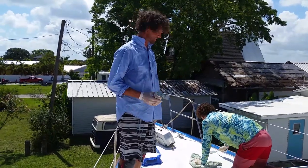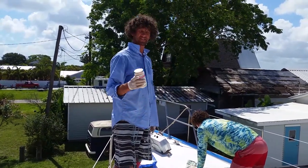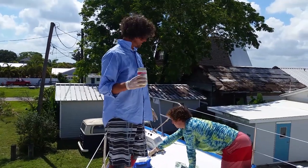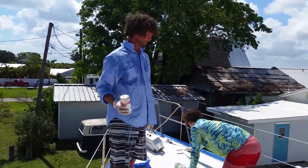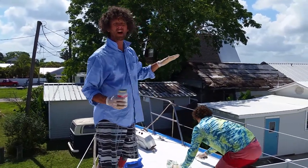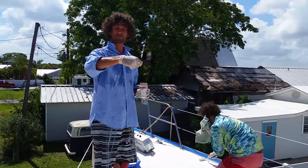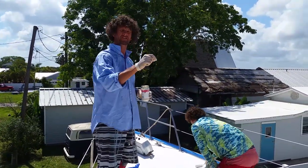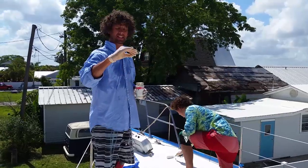This is our second coat — we missed out yesterday. Margarita worked like a bloody Trojan and put herself sick, so she's not allowed to paint today. You put a generous layer on — not too thick — sprinkle the sand on, wait a little bit until it tacks on, then do a very light one or two rolls over it. If you do more it tends to coagulate back onto the roller and come off in sections.